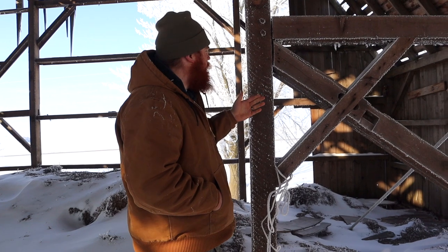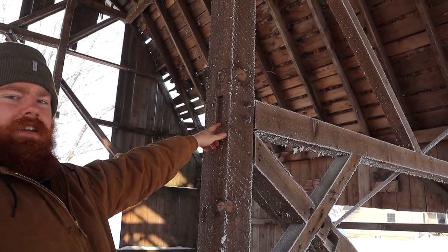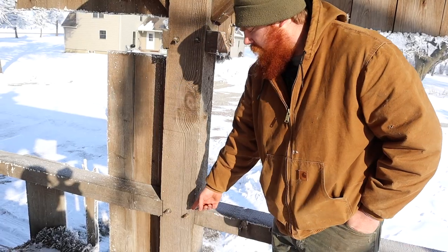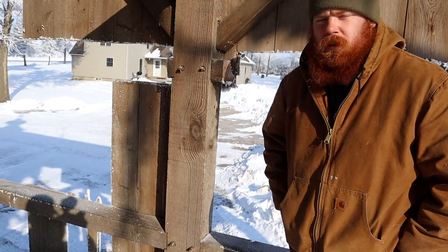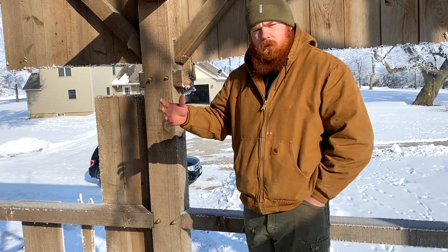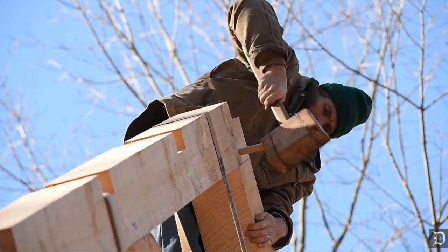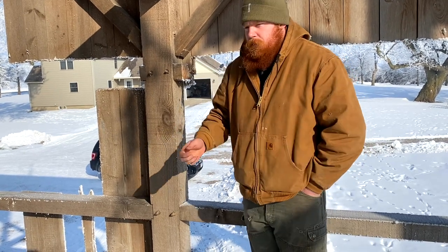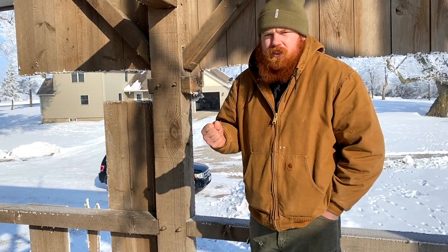This is another great example of the craftsmanship here. We've got the pegs, and you can actually see the tenon coming through the other side. You may think the pegs look a little weird — like why are they sticking out of the frame instead of being sawed flush with the beam? The reason they leave the peg sticking out a couple inches is so that over time, as the barn creaks and moves — because wood is always shifting — you can actually pound the peg in. Because of that draw boring method, it shrinks the joint and makes it super tight again. They leave these pegs sticking out so farmers could come back and knock them in to make everything nice and tight again.